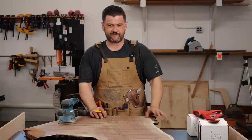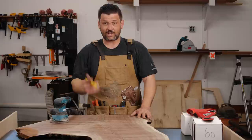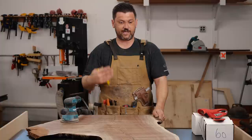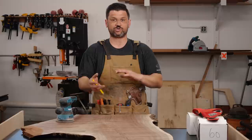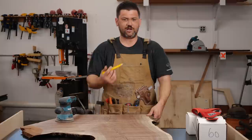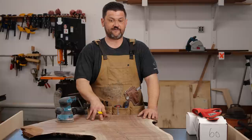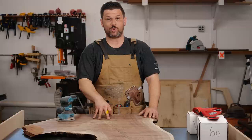We've got this thing flat on two sides. It got a very slight cup overnight — about a sixteenth of an inch over the whole length — which is really not a big deal. Now we'll take out the routing lines by sanding. I'm going to use 60 or 80 grit and the pencil trick: draw pencil lines over the whole surface and sand until they're gone, then repeat with a higher grit. That ensures you're removing equal amounts of material from every part. I'll only sand to 120 for now since I still need to add a wireless charging port, engraving, and a few other things.